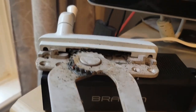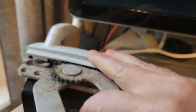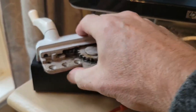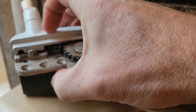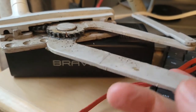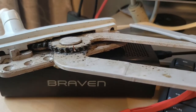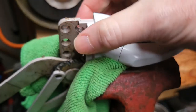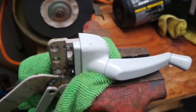The problem I've found with these is that they've just become loose. As you can see, this whole unit is just loose and sloppy and then it slips. This whole unit for me is all one piece, so all you really need to do to tighten it up is to clamp these two pieces — here and here. I've done one repair on another window already and just took a pair of vice grips and squeezed the metal together, which pinched it tight and tightened everything up.